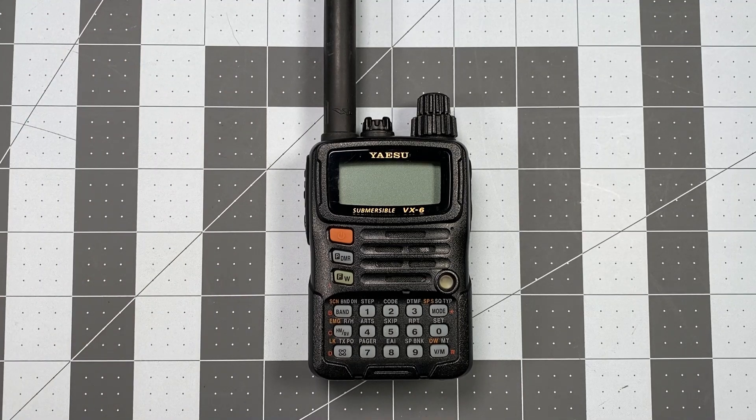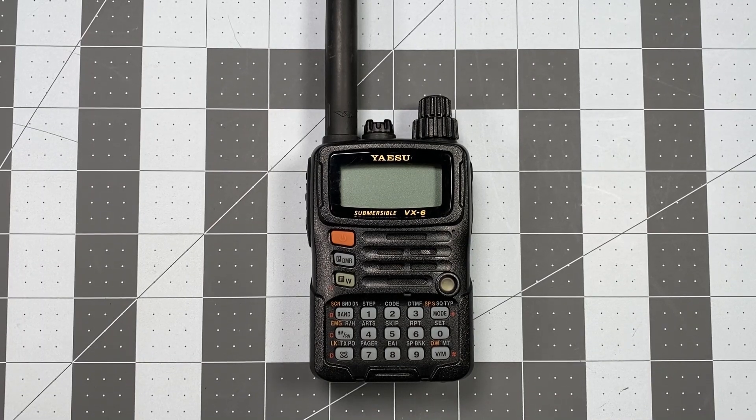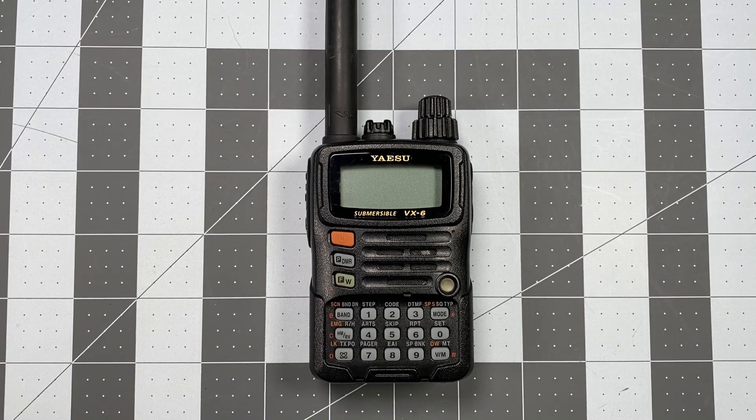Hi, this is Scott Kilos here at 6 Delta Alpha Yankee, and for today's video we're back with another Yaesu VX6 Operator Series video. In the last installment I showed you how to program simplex frequencies into memory channels, and for this video we're going to be doing the same except we'll be dealing with repeaters. I picked two different types of repeaters that we use here at the club — one involving tone squelch and one involving just tone. We'll be dealing with a receive frequency, a transmit frequency, either one or two CTCSS tones, and offset. So without further ado, let's go ahead and launch into it.